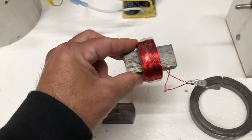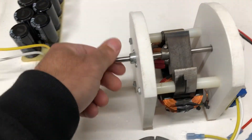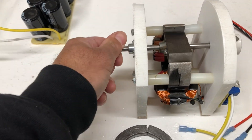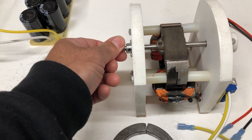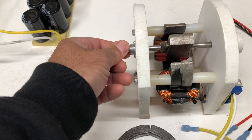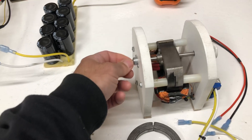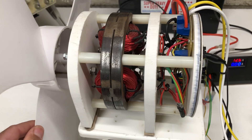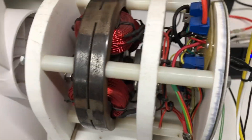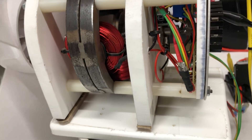I wound them up so they slide right on. It's very simple — no magnets, it just magnetizes the rotor, lines up, turns it off, lets it coast, and then lines up and turns it on and off. This one turns off twice per revolution. This one has more pull and uses optical timing, and it turns on and off four times per revolution.